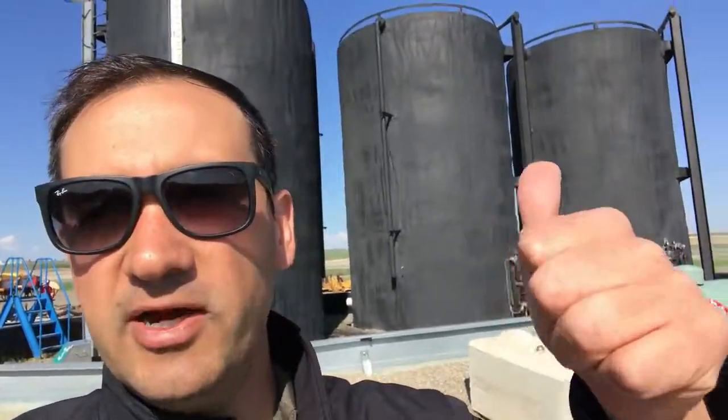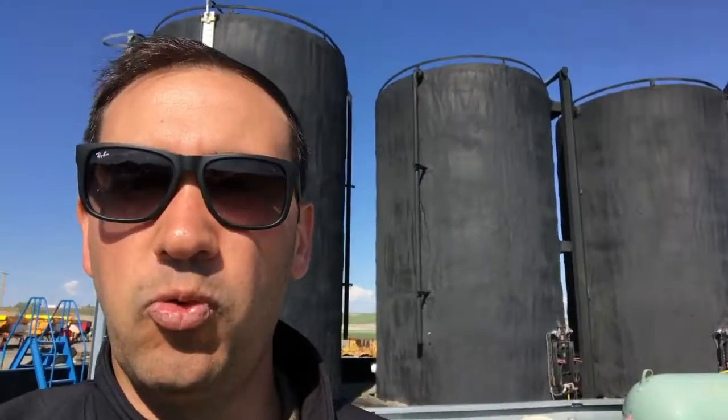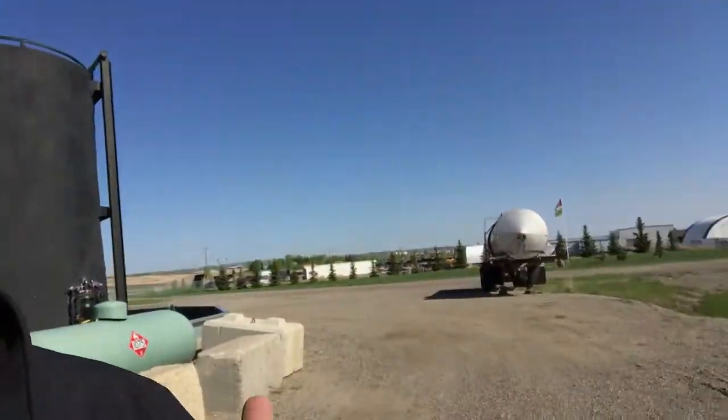To show you what we're doing here — we're over at one of the city districts here in Alberta, and these tanks behind me are asphalt tanks. One of the things with asphalt tanks is you have to keep these things around 70 degrees Celsius so that we can keep the asphalt moving and it's still warm when it shows up to site in the back of the asphalt trucks.